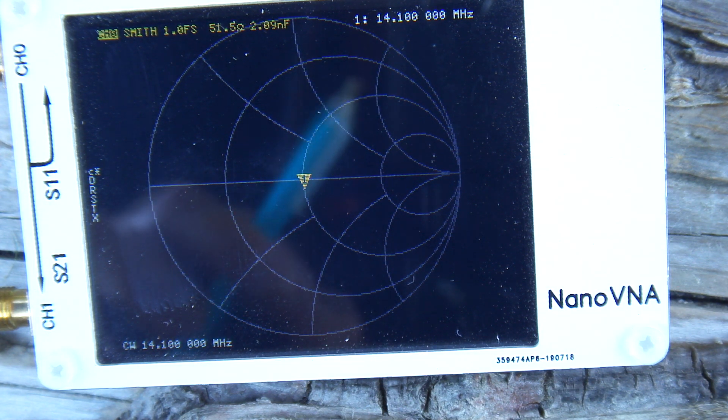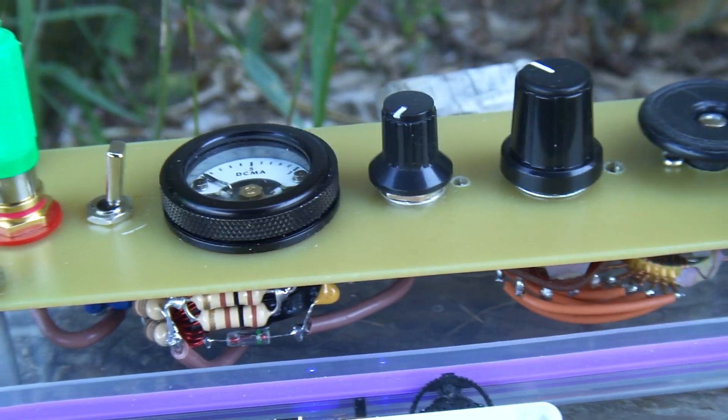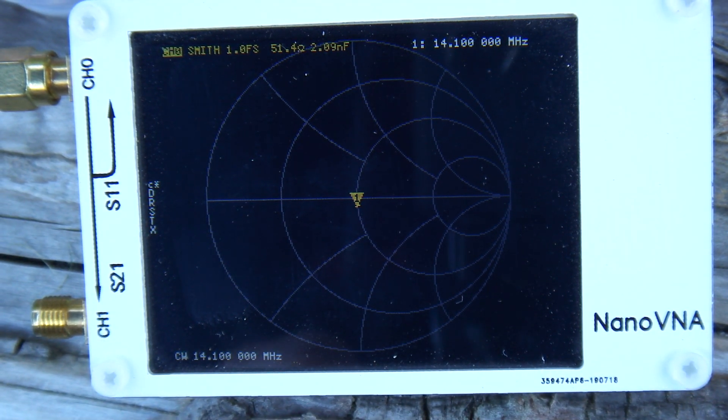So that's one 41 meter antenna with, as we can see there, a little tuner. At this stage of the game, unless I'm mistaken, it's managing to tune in — good enough — for 80 meters, 40 meters, 30 meters and 20 meters, with a 41 meter antenna and about 6.5 meters on the counterpoise. It's stinking hot down here, it's the middle of the day, so I'm going to call it quits and go back inside and carry on with the single sideband radio. I hope that clears up some of the questions that came out of the last video. 73s, take care and we'll see you next time.